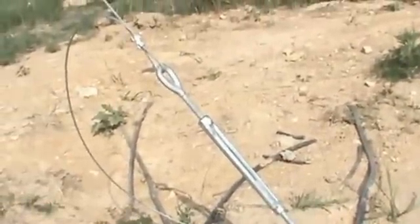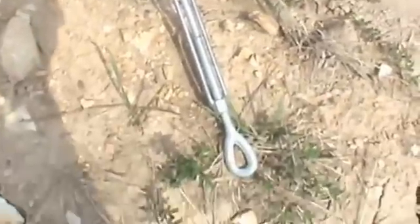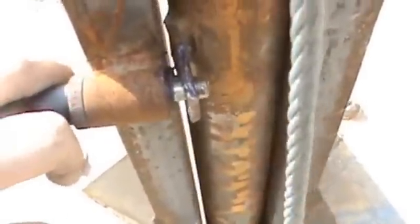These are the turnbuckles here on the guy wires. You don't want to have hook buckles — you need them solid like these, no hoops in them, no hook. Cable can come out of those. There's the handle — pull this pin, just pull it straight out, and then you can go ahead and reel it down.